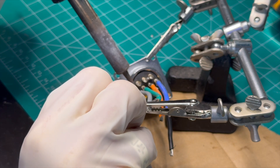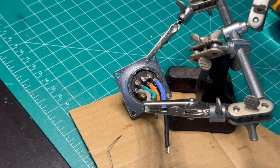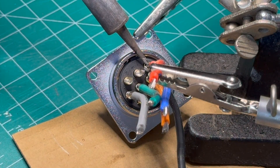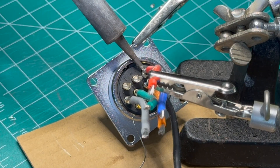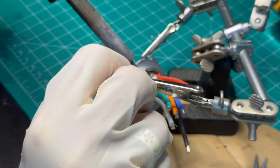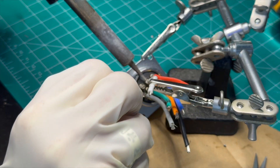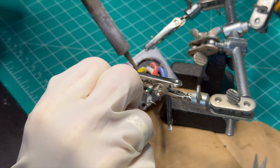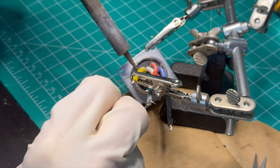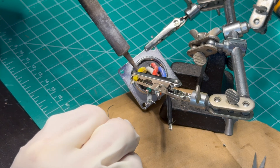Something that's important to note is that the order of the wiring here is absolutely essential. It's important that you write down, before you actually do this, what conductor goes into what terminal. And it's really easy as a reminder — each of those terminals has a number. The cable side and the side that actually goes on the layout are essentially mirror images of each other, so I'm soldering everything in exactly the opposite order as I soldered them for the ends of the cable. For that reason, I kept the sheet of paper that I had written down the numeric order of each of these wires so that I could refer to it continuously. The last thing I want to do is try to think deeply on it or use my memory — it's best just to have the sheet written down. You don't need to be connecting wires in random order.